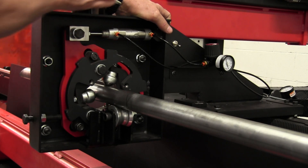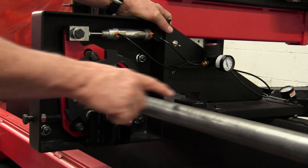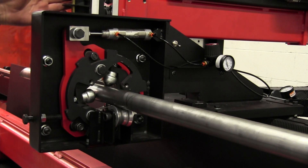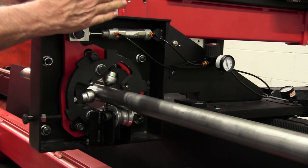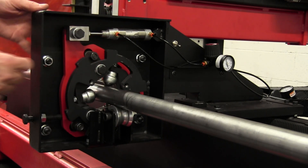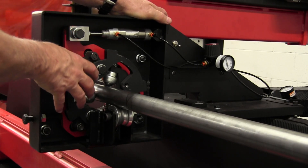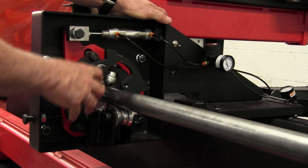In order to help with that, we allow you to move the stabilizer back. Also, if you're doing a very long notch — say a 60 or 70 degree notch — you need a pretty good distance between the torch and the stabilizer balls, or the balls will fall into the cutout and ruin your piece. We definitely don't want that.